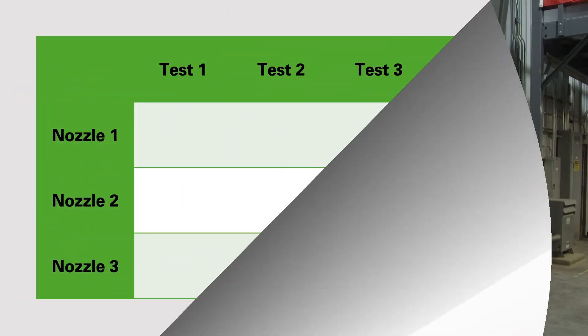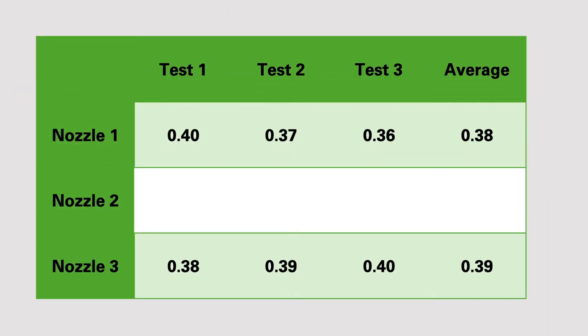We wanted to illustrate the usefulness and consistency of using this tool to check your flow rates on your nozzles, so we repeated this test three times. Across these three tests, nozzles one and three were relatively consistent, all with flow rates about 0.38 or 0.39, which is right where we would expect them to be with the given nozzle and pressure. However, nozzle two was consistently low with a flow rate around 0.23 gallons per minute average, so there's likely something restricting flow to that nozzle that we should investigate before using it in the field.